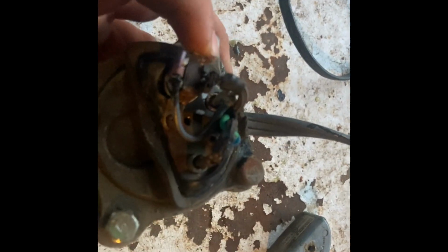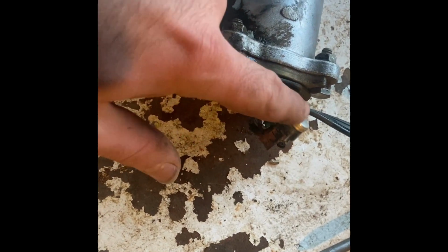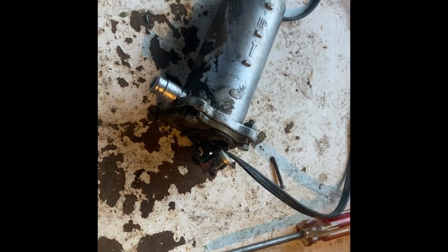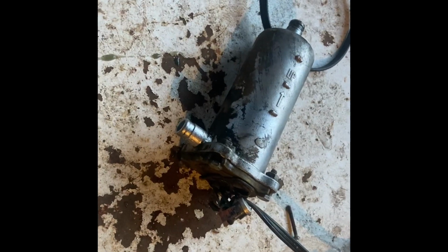So yeah, I got the temperature sensor out, and terminals are shaking and wiggling all over the place on it, where they should not be wiggling. And it's very crispy smelling, shall we say. So new heater required. New heater is definitely required, so there we go.